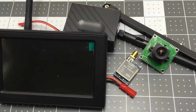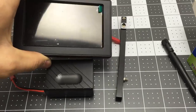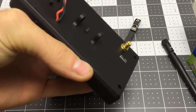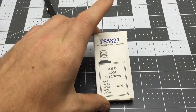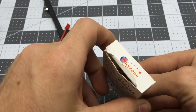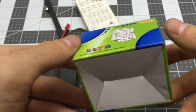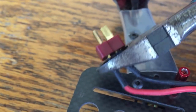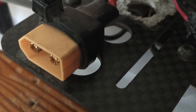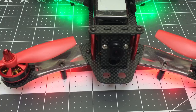The battery actually lasts a good 10 minutes or more, which is very nice. So I got their FPV equipment in the mail, giving me the opportunity to see what components they're using. There's a cute little monitor with a built-in receiver, some sort of battery to power the monitor which turns out to be a 2S LiPo in a box, a 200 milliwatt video transmitter, and an FPV camera with virtually no information on the box at all. I decided to change the battery connector to an XT60 since that's what everything else I own uses. I installed all the equipment and it all just worked right away — same channel and everything.